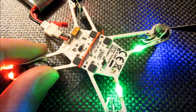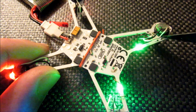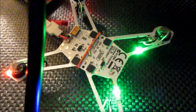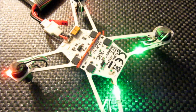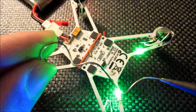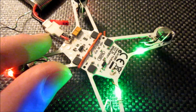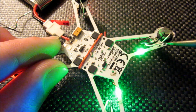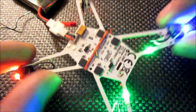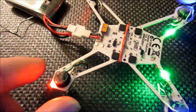Let's turn it on the lower one. It does seem to be in here. Loose connection right there. So that one I can't push it down, so I'm going to add some solder to that. Just get a little bit on the tip. See, I'm not using a fine tip here either, but it doesn't seem to be too necessary. And I'm just going to go in and tap that really quickly. There we go, done. And now it can survive some wiggling and seems to be staying on pretty good.